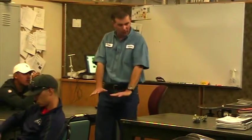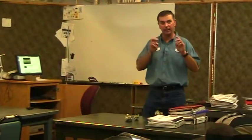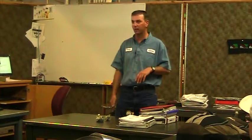Same thing with a riding and walking greens mower. Every time I put one of those options on it, the physical cutting unit weighs more. It's going to sink into the grass more, and the more options I put on there, the shorter the grass is going to be. And so you're going to compensate. As a technician, you're going to set it at 90 thousandths. And then you add all these attachments and you set it at 90 thousandths, you take it out there and the superintendent's like, whoa, wow, that thing's cutting way too short. Grass is getting stressed, we need to raise the height of cut. So you're going to raise the height of cut because you're compensating for the weight.